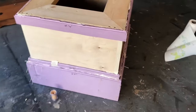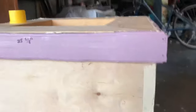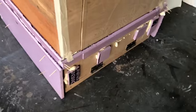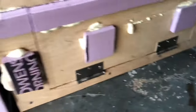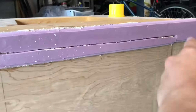I started work on the molding for the base of the column. The top pieces are all 3 inches in width — using the router table to create that decorative edge does make it a little smaller. The longer piece is 25 and 5/8 inches and overlaps on the corner, and the smaller piece is 24 and 5/8 inches. The bottom pieces have the same decorative edge. The side piece is 26 inches, the front piece is 27 inches and overlaps right there. With the back trap doors, you do have to cut around the molding so it's able to open — just cut around the top and cut straight down on the bottom pieces.